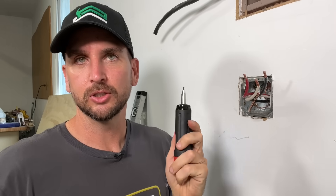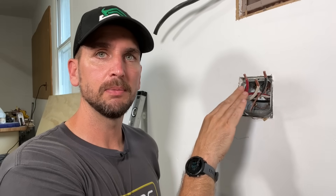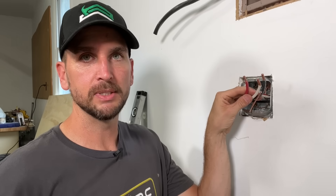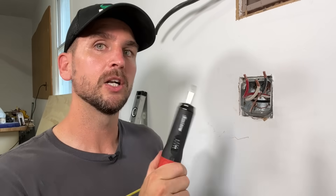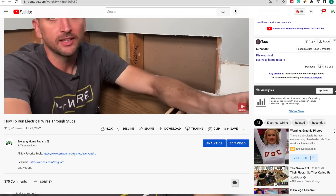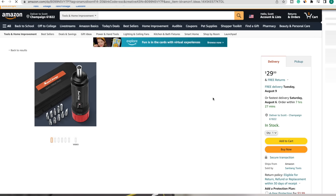That $30 additional piece in the supplies is actually a torquing screwdriver. I can adjust the torque in inch-pounds to match the spec on the NEMA 14-50 outlet and what the screw terminals should be tightened down to — that gives me confidence I'm installing it correctly. You also need to be careful when dealing with stranded wire, which I'll show in a minute. Your breaker will also have an inch-pound callout for those screw terminals. Professional models cost hundreds of dollars, but for a DIYer using it a couple times a year, the $30 price tag is exactly right. You can find a link in the description to all the supplies and our Amazon store, where the electrical section has tools like this recommended for DIYers.